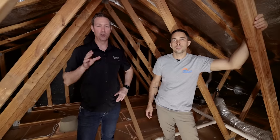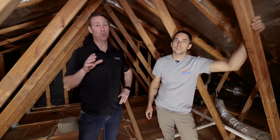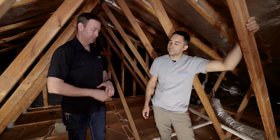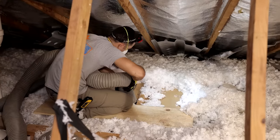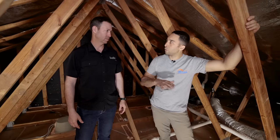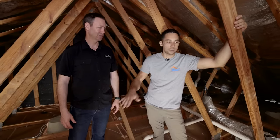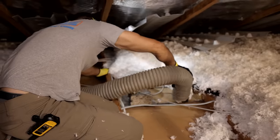Let me introduce you to Quincy Bishop with True R Value — this is not just an insulation company, it's a home performance company. Quincy, you did a great job sucking this insulation out — it almost looks like new construction even though the house is 40 years old. Talk to me about that process. The insulation removal is the most difficult part. You had fiberglass, so it wasn't too bad, but cellulose and rock wool are really dense and heavy. It's important to get it all out so you can expose the attic floor and see all the penetrations you need to seal.